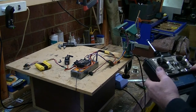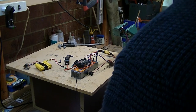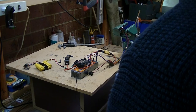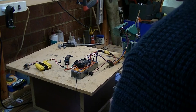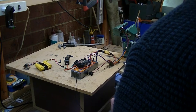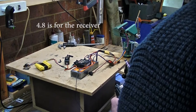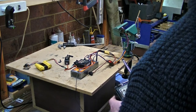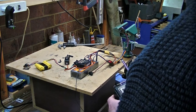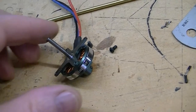Now I'm just going to test out the new system. I've got the speed controller and the LiPo. I've also added another 4.8-volt battery because I thought I could run it all off the 6-volt lead-acid, but the brushless motor and speed controller really do need 7.4 volts from the LiPo. I'm just going through the process of getting the extremes of the throttle travel calibrated.